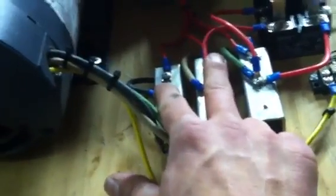Inside this motor there are instructions to wire it for 240V. This motor was rated for 240 or 480 — maybe 208/240 or something. Just make sure it's connected correctly inside. All three legs — labeled A, B, C or 1, 2, 3 — come in there. You've got two hot legs going into the motor and a third leg that's generated, coming back out.